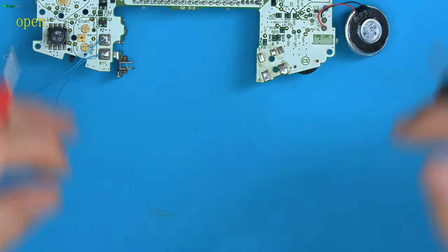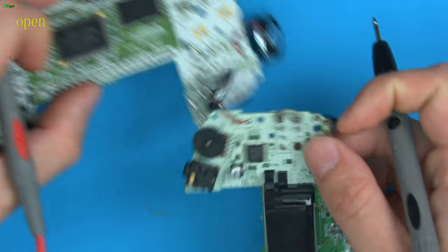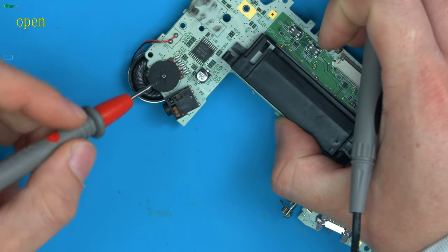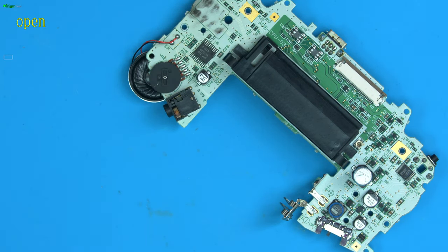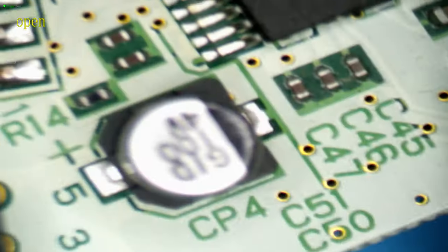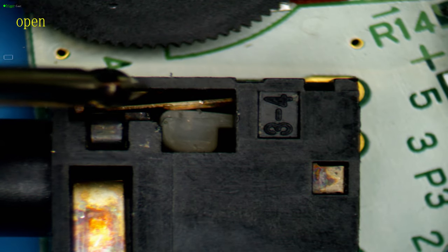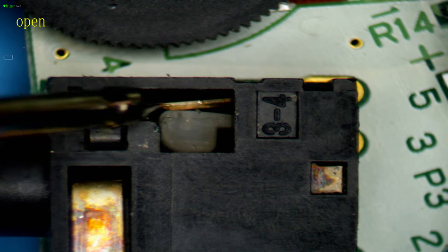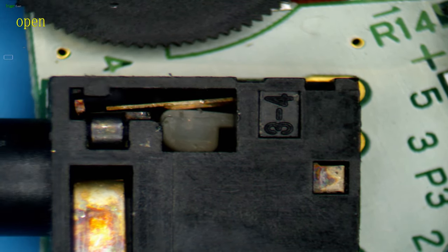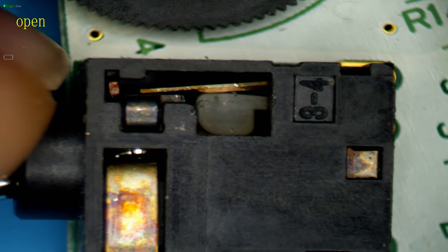Now, you might think that's always the case, but if we look at our current board, what we should find is 4 is ground, which it is, but 5 shouldn't be. And why is that? It's because in this headphone socket, and specifically here, is a spring. So when we insert something into the socket, let me see if I can get this on scope for you. So you can see inside the headphone socket here, if we connect the testers to ground, and we can see in here and touch this, this is ground. And see this pin here that goes to pin 5? This is this metal pin that comes along here and touches this, which is pin 4. So this is pin 4, this arm is pin 5. When we insert a headphone plug into the slot, so if I just insert the testers, you can see, if I can do it right, it does this.